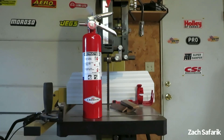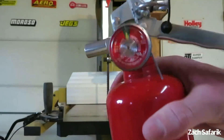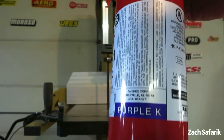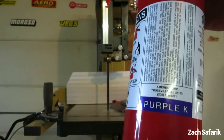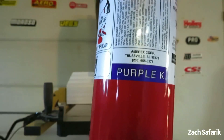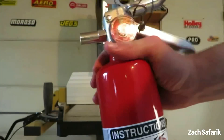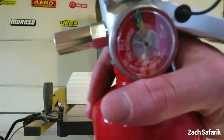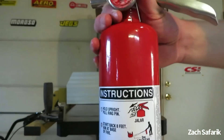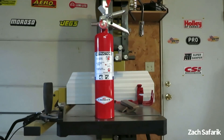I've always wondered how well Purple K does on a fire, so I'll be going out and testing it. Purple K is a little more expensive because it's a different kind of agent — not your typical go-to for most applications. But if you're in an industrial environment dealing with a lot of class B materials and you're looking for something beyond sodium bicarbonate or monoammonium phosphate, Purple K is the way to go. They make it in two-and-a-half pound, five pound, and 20 pound units, and there are high-flow and fast-flow models available as well.